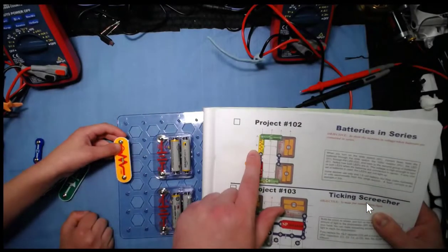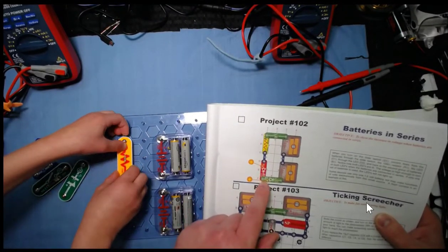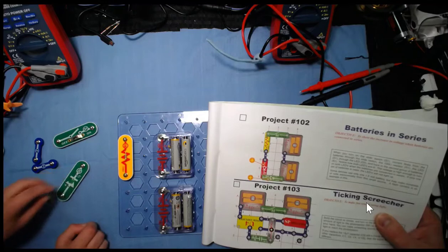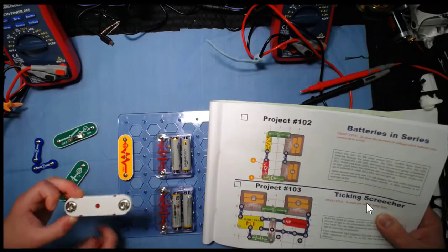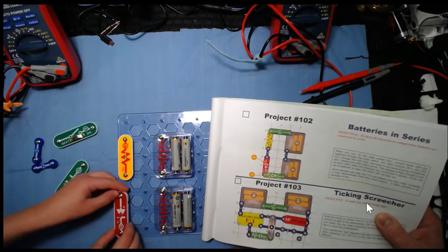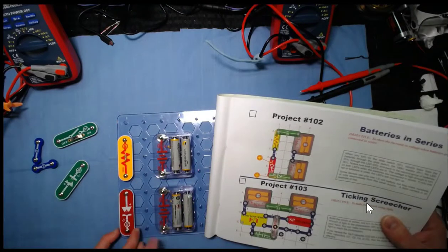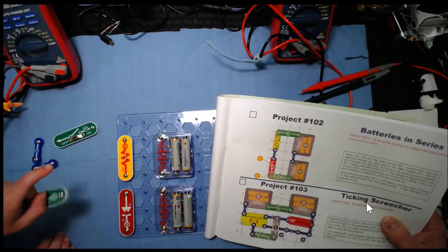Now we're gonna need the resistor, which is 100 ohms. This is a 2. Don't put it on. So we need the red LED. It looks like a white diode. Make sure you got the positive, because these have a polarity to them. It doesn't matter which side it is on, just look toward the arrow. The conventional current is going to flow through it as the drawing shows.